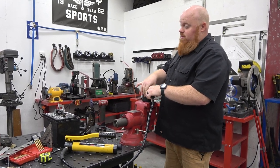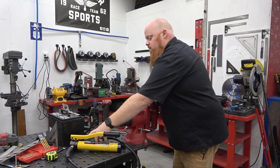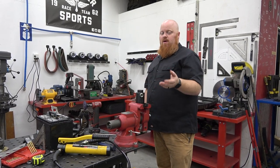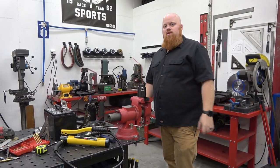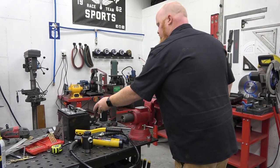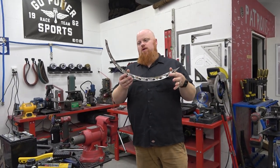That was a long process. I only showed you a few holes. It's not really technically made for this big, 1/8 inch thick steel, but I didn't want to use thin stuff because I'm lazy and I already have sheet metal the width that I needed to cut. So now we have to straighten up this unicorn piece of steel. This is what happens when you dimple die so many holes so close together.